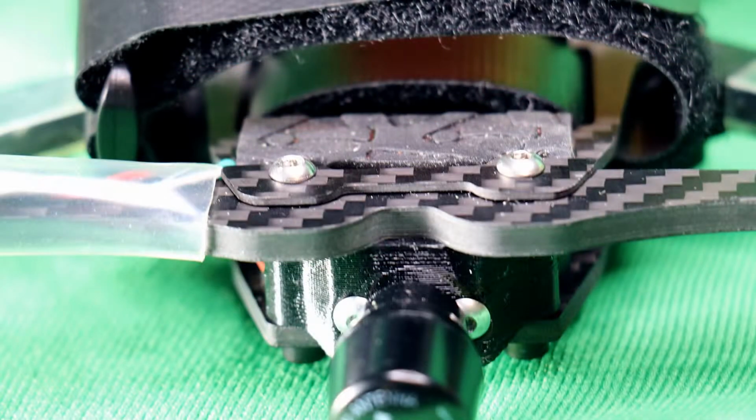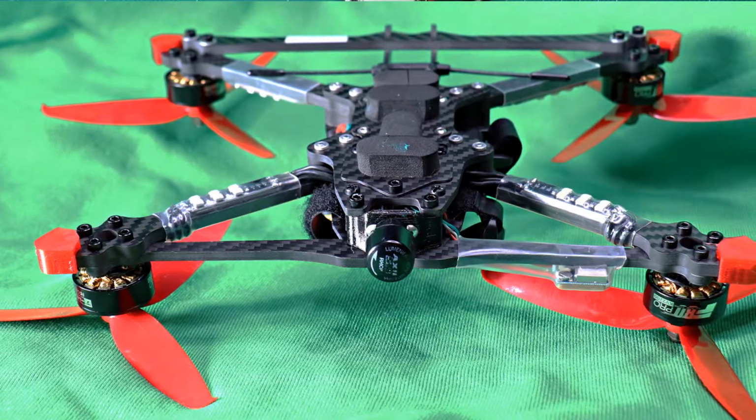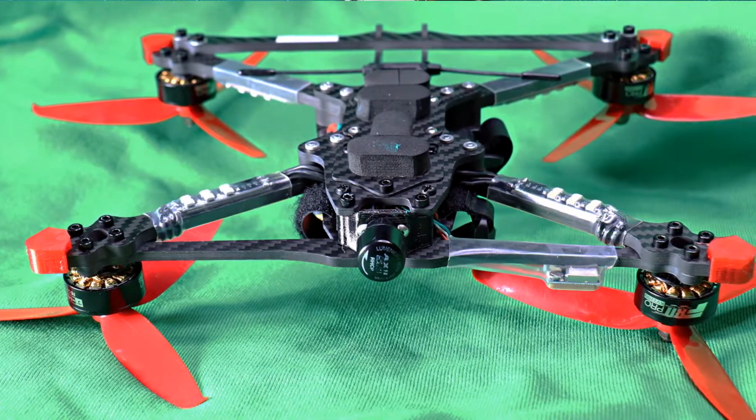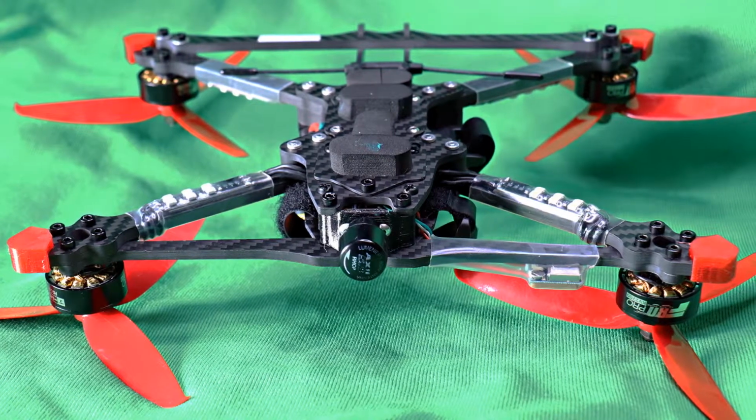When you have the back brace on correctly, then when you put the back brace keeper on with the 2mm spacers, it's perfect. If it's not working right for you, please check where you positioned the back brace and the arms and the motor in the rear. You probably screwed it up like I did. Okay, let's get back to the video now.